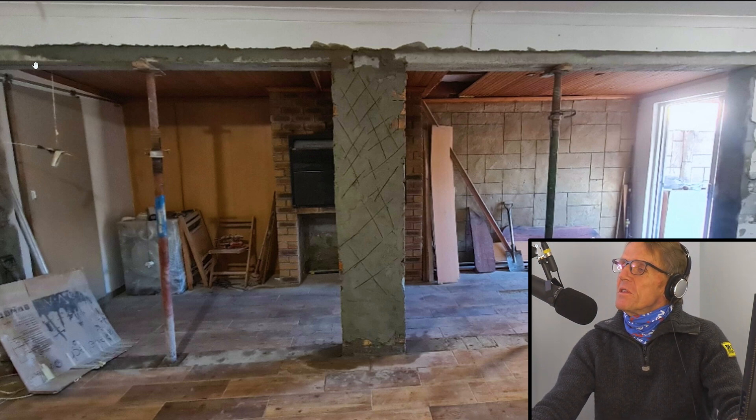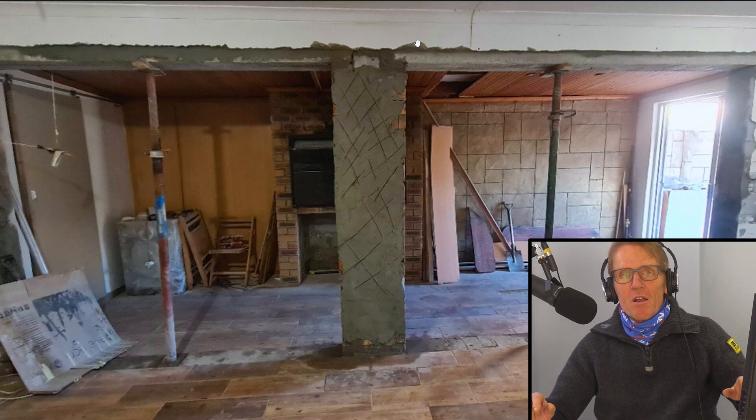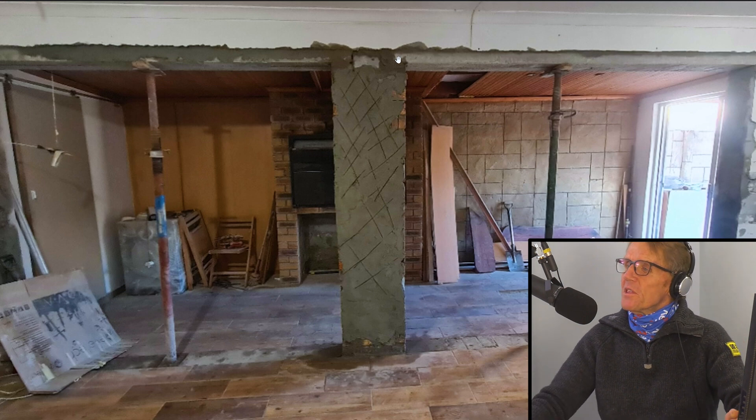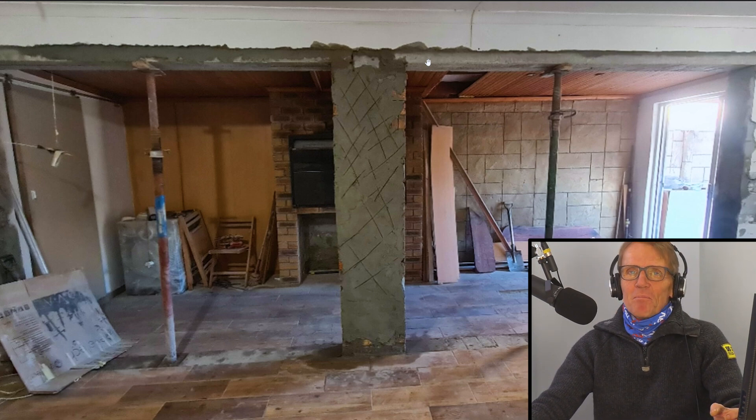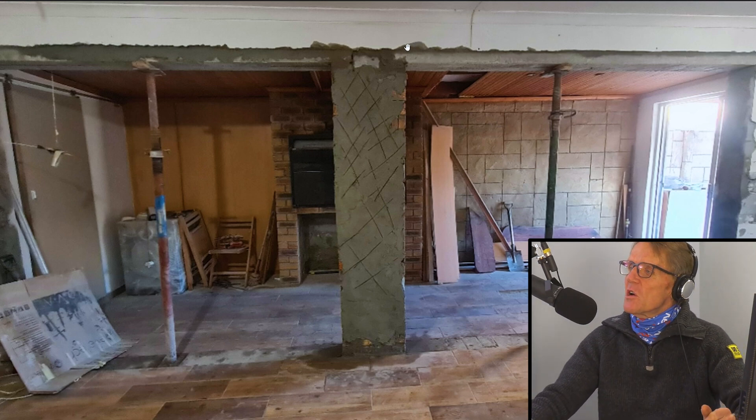They've chopped all this lot out and put in these concrete plank lintels. These are pre-stressed lintels — the same thickness as a course of bricks, roughly 75mm thick, and you just bed them in where the bricks would go. They're a great idea and very good, but they're intended for use when you're actually building the wall, where you need several courses of brickwork built in above them at the same time — rather than just chopping out the brickwork and pushing them in underneath as done here. It's just not the right product, basically. There's something about the way that the brickwork and the lintel work integrally as one.